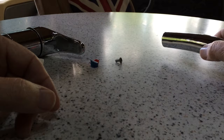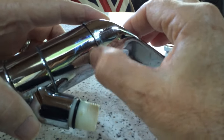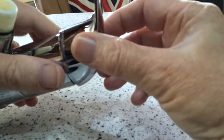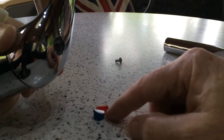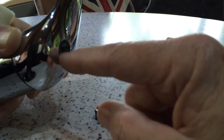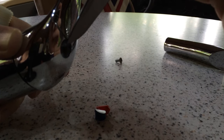If that doesn't fix it, or that isn't the problem, and the tap is still leaking and leaving pools of water on your work surface, you'll need to investigate further. In the body of the tap there's a replaceable cartridge, so it's not necessarily going to need a whole new tap. But to get to the cartridge you first have to prize out the little blue and red hot and cold marker buttons in this receptacle area here.